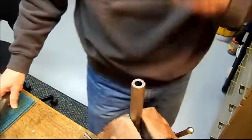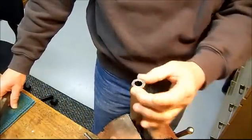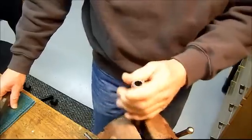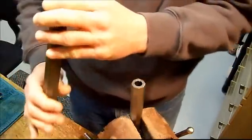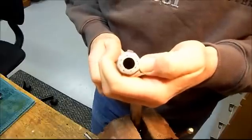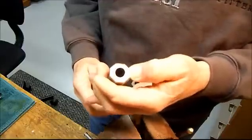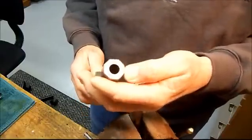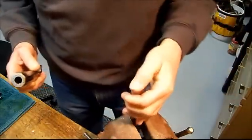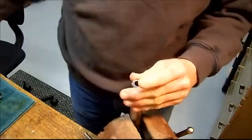I'm going to play with the muzzle-loading rifle barrel one more time today. Last time I showed you how to cut that off, square it, crown it, and file your shape to it. Today I'm going to show you how to just dress it up a little bit — make it different than the one your buddy has. You can do this on an existing rifle you already have. This is a new rifle I'm building — it's going to be a .50 caliber flintlock when it's all said and done.